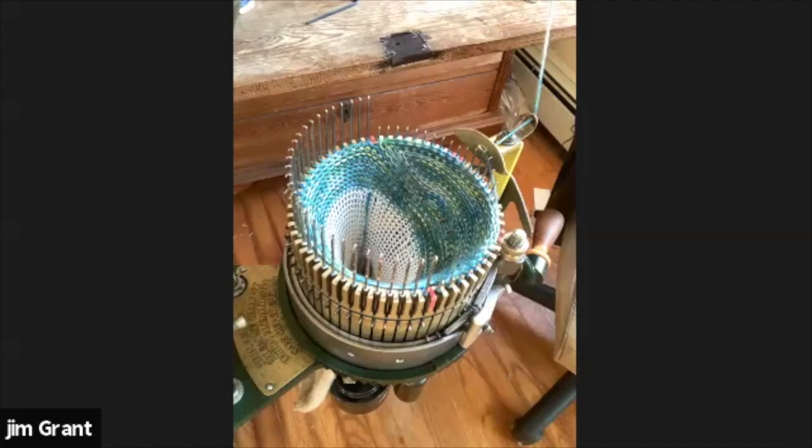Okay, you've got to try and pull that needle out. They go in just by the needle, the butt goes into the spring. Right. So actually look ahead of where your yarn carrier is, where it jams, are you jamming somewhere up there? It's like the yarn carrier hitting one of the needle butts of the needles that are out. Do you have needles out of work? Yeah. That's the only one that looks off. Let's see if I can lift this.